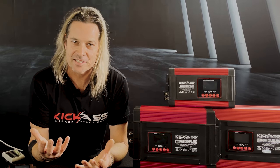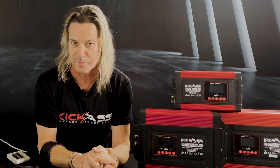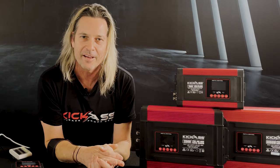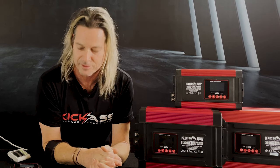Another way to look at headroom is your car's tacho — you've got your red zone at 5,000, 6,000, 7,000 RPM, and usually you don't drive your car at that red line because it's just screaming its head off. It's the same with an inverter: we want the inverter to work nice and efficiently at a low RPM like your car. That gives you a rough idea of how headroom works — we want at least a couple hundred watts of headroom over our devices.